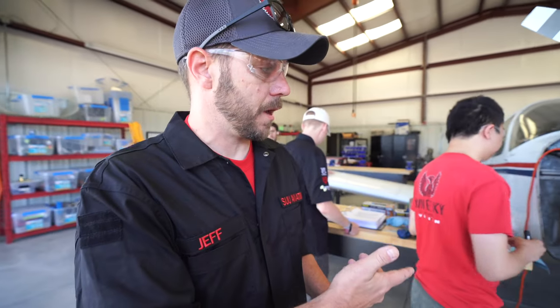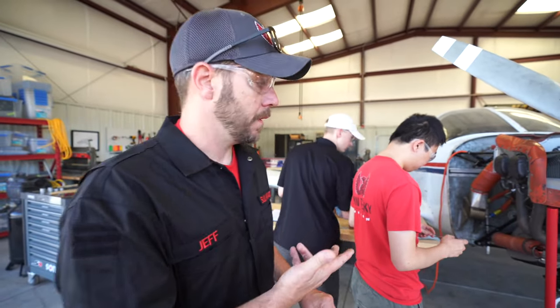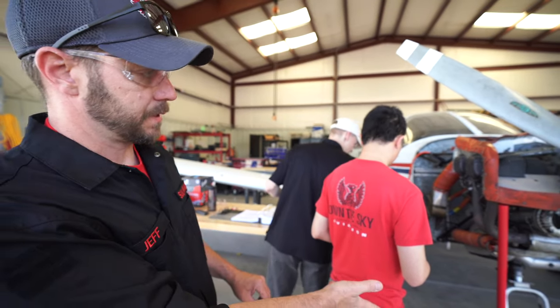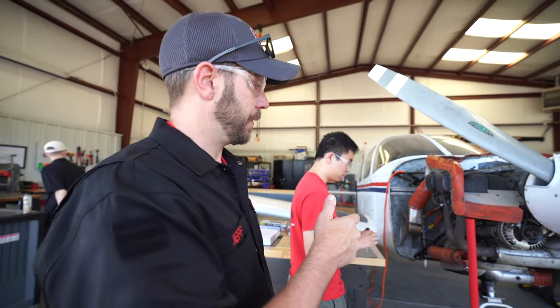We've compressed the strut, we've serviced it, we've bled out all of the old fluid, and tried to replace it with new fluid. We've done mostly that. We'll compress the strut again. As you can see, it's compressed to allow no more air to be introduced into the strut. Now we're going to cap it off with the valve core.